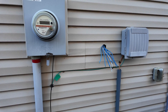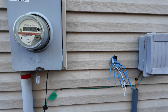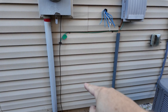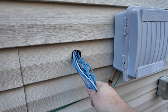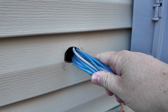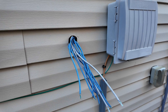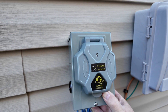This is outside the house, directly on the other side of the breaker panel. We can see the meter right there — the panel is right behind it. Now I have the outlet box that I'm going to attach here. Normally I would attach it lower down, but there are some cat-5 cables sticking out of the house with a gaping hole. Since I don't use these and there's already an existing hole, I'm going to shove those cables back in and put the box right there.